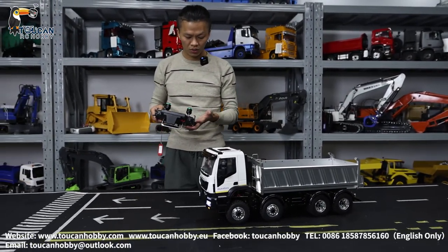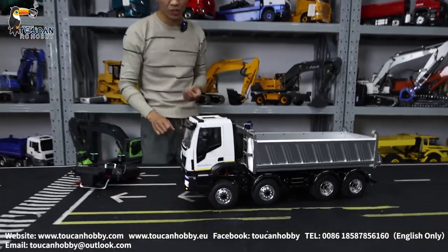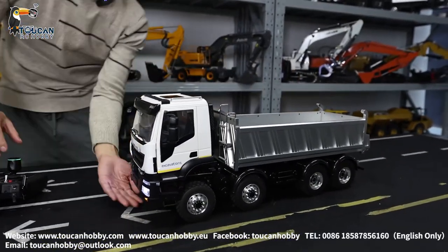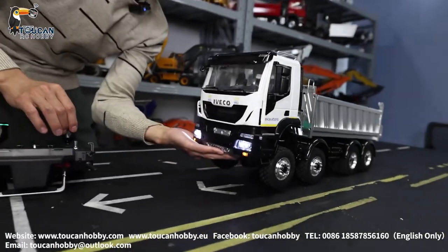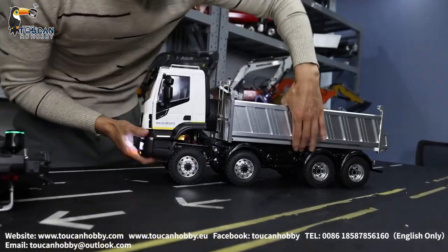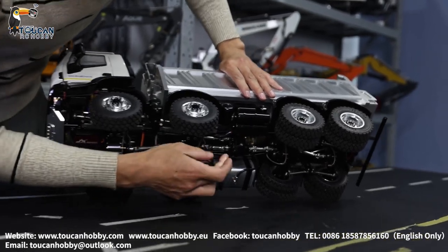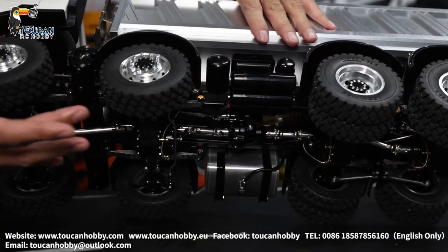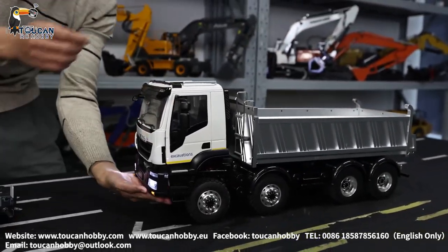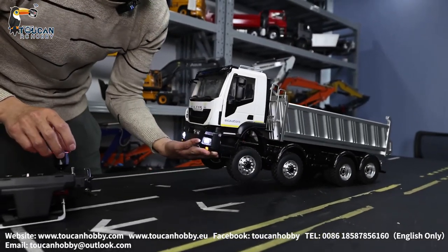It's at neutral position. I put low speed again. And we will see how the differential lock and the middle transfer lock are working. You will see all locks are currently unlocked. The middle transfer case is at this position, so the power transfers to the rear two axles and the front two axles. Without the transfer case locked, it can be driving only the front two axles or the rear two axles.